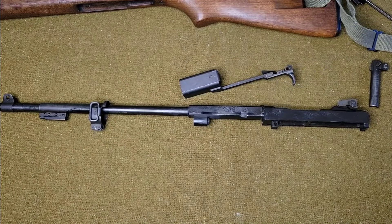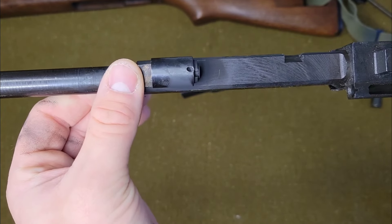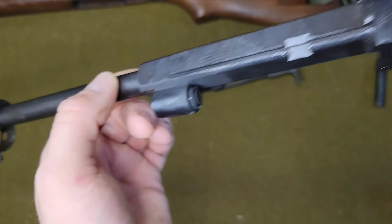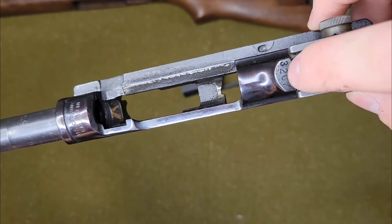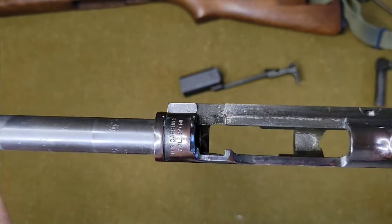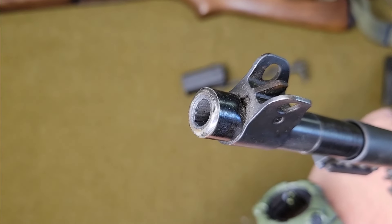So we went and took our M1 carbine down here so you can take a look at what they've done. Like I said, they took an M1903A3 barrel and turned it down. Later in production they put on these kind of gas block sections and welded them on in place. You can see we've got our standard USGI piston head and piston collar. And we can get a look at that cast receiver — they did do castings. You can also notice that Alpine located the serial number right here in front of the front sight base, though some of them have been located in different spots on different models. We can also get a better look at our milsurp barrel band lug and our Underwood-marked front sight post.